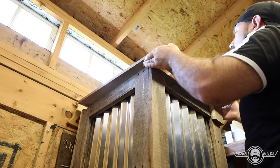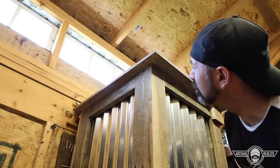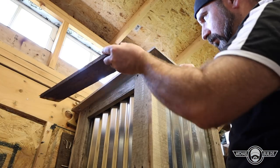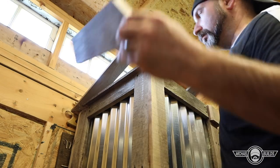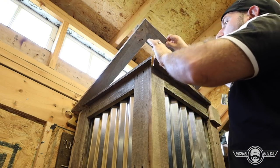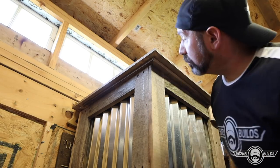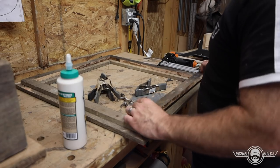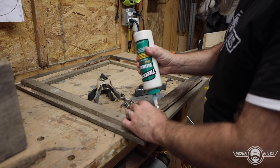After dry fitting the lid, I just wasn't happy with the look. So I added some 1.5 by 23 inch strips with a 1/2 inch reveal to give it kind of a stepped look. This not only made it more pleasing to the eye, but it also added some thickness and rigidity to the lid. It also gave me a great place to mount the LED strips underneath.